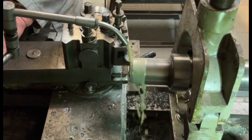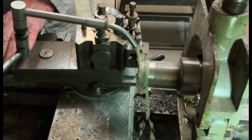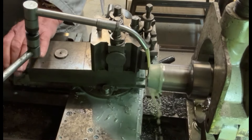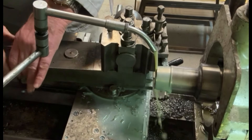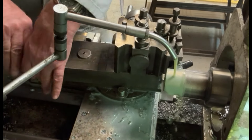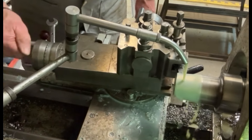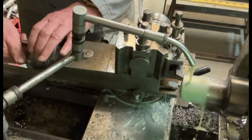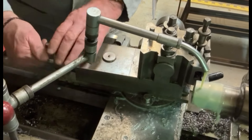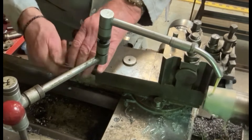I've now fitted the piece that I turned up earlier on, screwed it into the end of the shaft, and I've welded it in place. I've remounted this in the lathe in the centre steady, and I've turned the tool post at five degrees to turn the taper on. It's a bit labour intensive because I have to do it manually, winding the tool post in to get the taper. I don't have a taper attachment on my lathe, but it's coming out quite nicely. It's going to be a bit of a long drawn out job and I've got to be careful — I can't turn it too quickly.